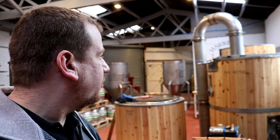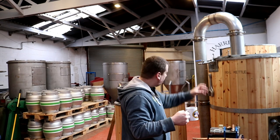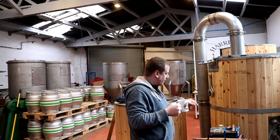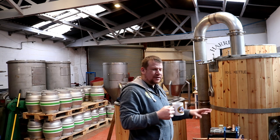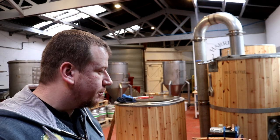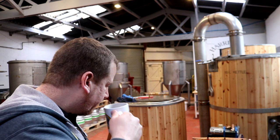So we'll get some mounts fabbed up today, have a look how they sit, dry fit them, and then see if we can begin to cut some stainless steel pipework for the product. So we want one to go back into the top port here, after the pump, into here. We've got to get out of the pump into the chiller, and then out of the chiller into there. So there's going to be a selection of valves and T's, and then also we want to go from there to the spray ball on the top so we can recirculate caustic as well, and out of the base into the pump. So it's quite a lot of pipe work to think about. It's just how do we tee it all together and get it working is the big question. Suck it and see, I guess.